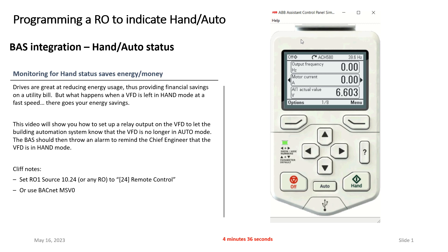And for all the controls contractors out there, don't forget to throw an alarm in your automation system when you see that the drive is in hand mode, to remind the chief engineer and the folks in charge of the facility that the drive's in hand — don't forget about it.